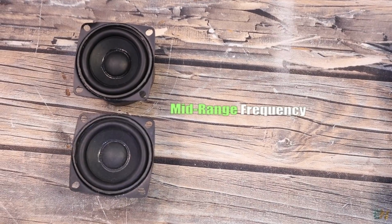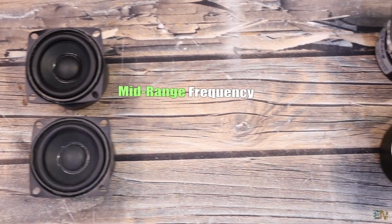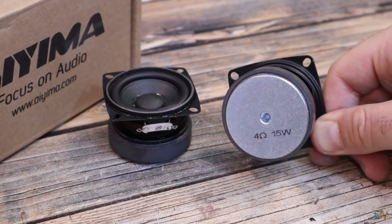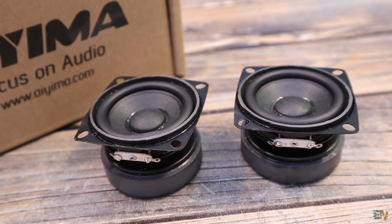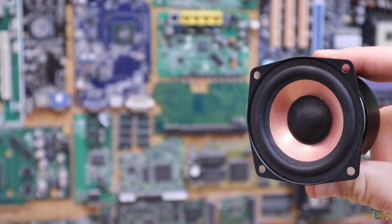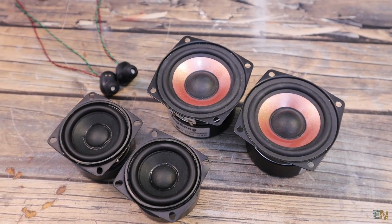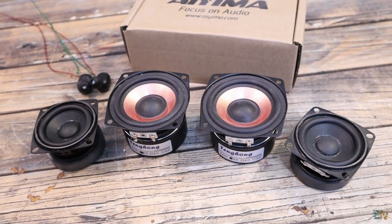The idea is to use two different modules, one for the medium range and the treble frequencies, and these other ones as subwoofers for the deep bass sound. The mid-range speakers are of 15 watts, and the frequency responds from 100 to 20,000 Hz. On the other hand, this one is also 15 watts, but is made to work better with those low frequency sounds for the bass. So make sure that you buy two of each, because we'll make a stereo system. The links for these ones are below in the description.